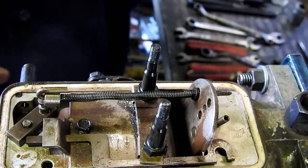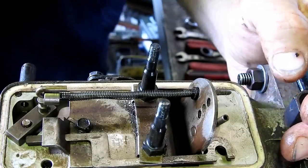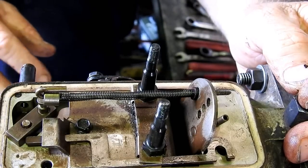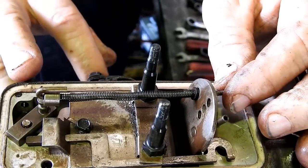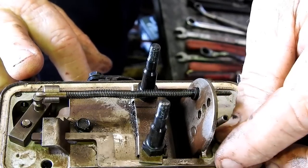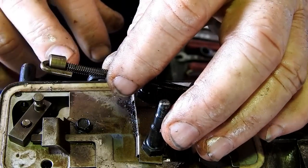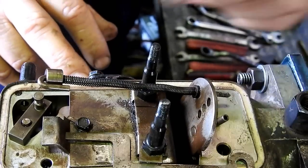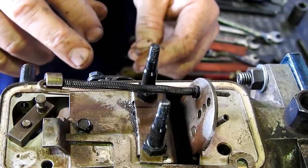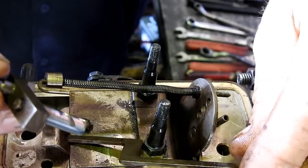So what can happen is you're driving along. I'm having shadow troubles here this morning. I've got big overhead lights and all, you'd wonder why. But anyway, you can actually park your tractor up and push the stopper on, and then if this metering valve is a bit sticky, well, the stopper can come back off, but it'll be stuck in that off position because that's where it all cooled down. So look, something to keep in mind, that metering valve does a lot.